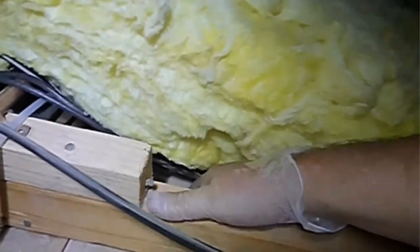We want to keep the house tighter and well insulated. You can see here this is R19 insulation that they've laid on the attic floor. We need to have R43 - that's the APS standard. APS requires R43. Now this is nominally R19, but in reality it's closer to R4, because this insulation is not touching the area it's supposed to insulate.